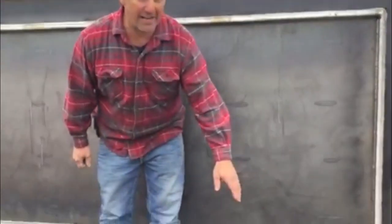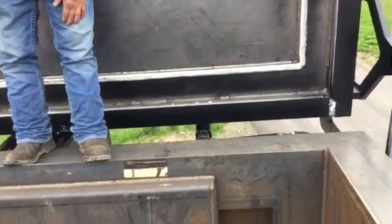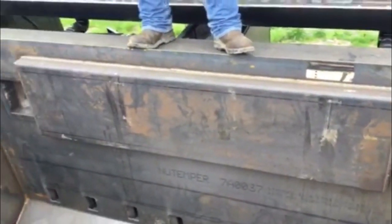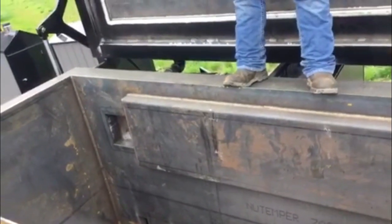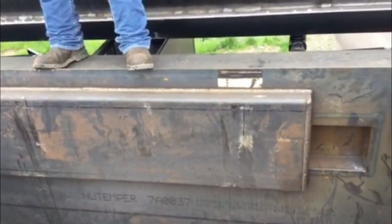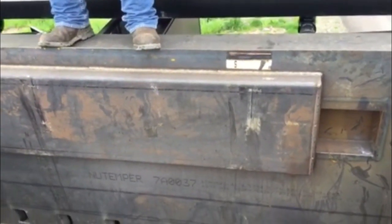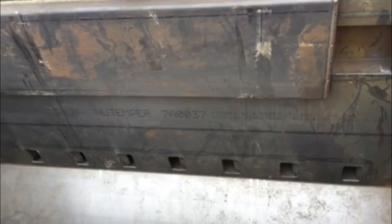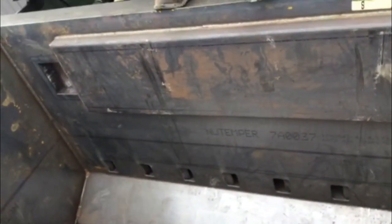If we look here inside of the boiler, the firebox, it's entirely water jacketed. These 2 ports, one on the other side, are where the exhaust goes into. It's water jacketed on both sides to strip off as much heat as possible. On the bottom, you'll notice a series of holes. That's where the air induction comes in, so we have the ability to burn the logs.